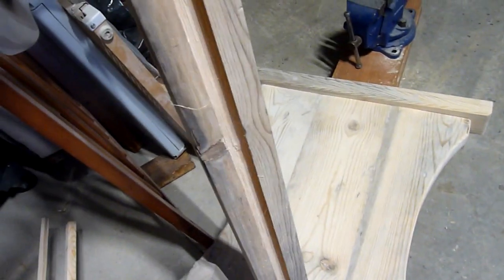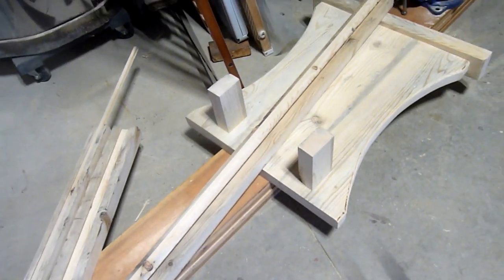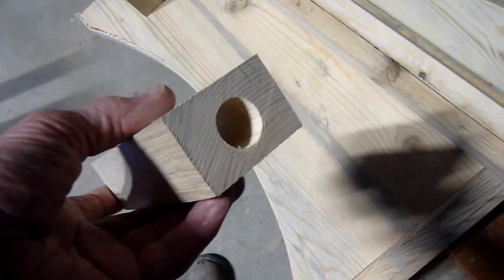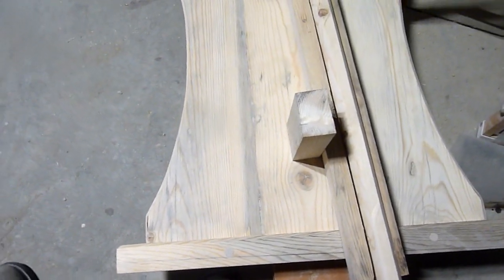And then the runner goes in there, and the inside piece will be attached to the box, which is this, and that will slide inside like that. And then this edge here is what will attach to the box that holds that, so it can't swivel too much. And then there'll be a third one down below, which is smaller, just to add a little bit of stability. Same idea, one-inch dowel, probably somewhere around there, to figure out the exact spot for ankle clearance, so somebody doesn't bash their shin.